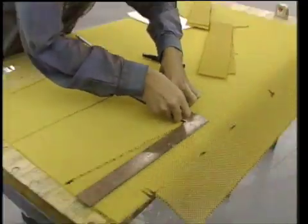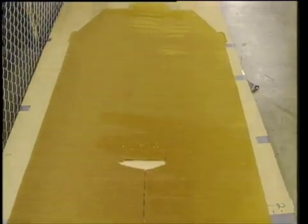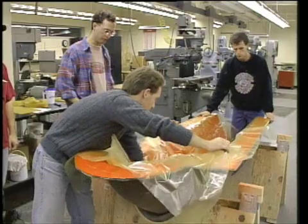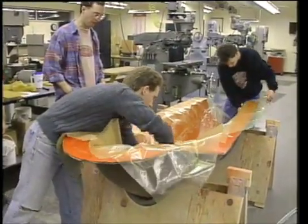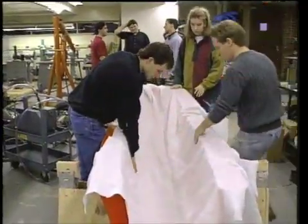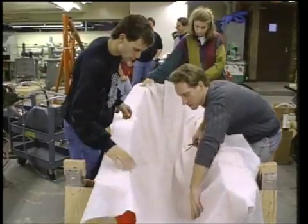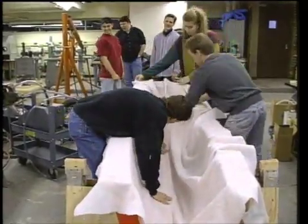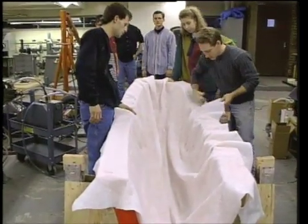The cut sheet of honeycomb was also rolled, labeled, and set aside for use in the proper mold half after the correct number of layers of carbon fiber had been applied. Finally, you will want to pre-cut all of your vacuum bagging materials. Unlike your reinforcements or honeycomb, these need to be considerably larger than your part to allow enough room for sealing and adjustments. It is not necessary to use a template for your vacuum bagging materials. Just be sure that you have allowed more than enough to cover your part and build the bag. Cut your vacuum bagging materials before you begin laminating and also set them aside in the order that they will be used.